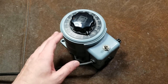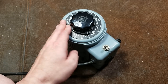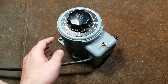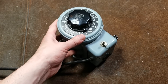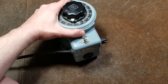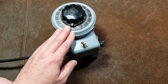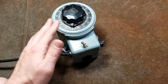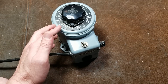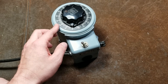Caddis Maximus here with a review of a 10-amp variable AC transformer. This happens to be a Superior Electric out of Bristol, Connecticut. These are very handy because they are exactly what they sound like - a transformer you can just plug into the wall. They generally come in a few base sizes; the 10-amp is one of the larger ones, although they do make 20 and 30-amp versions. This happens to be a 115-volt version but they make them in 220-volt as well.